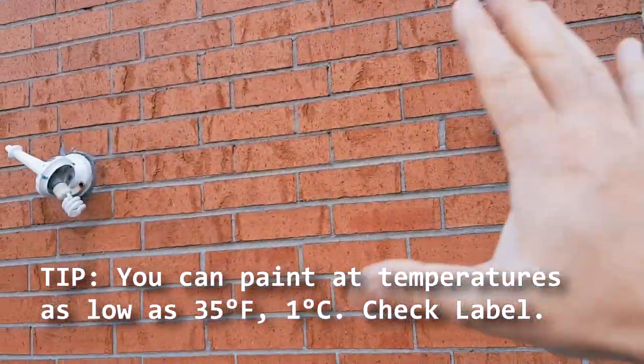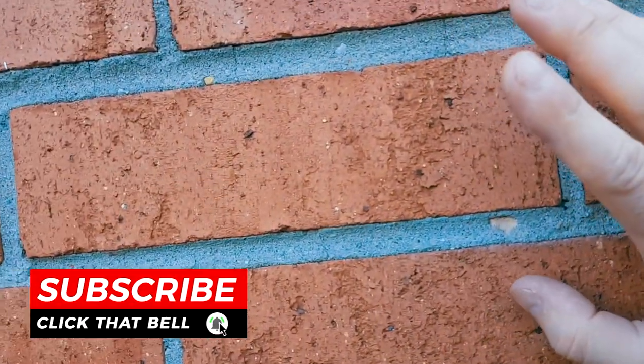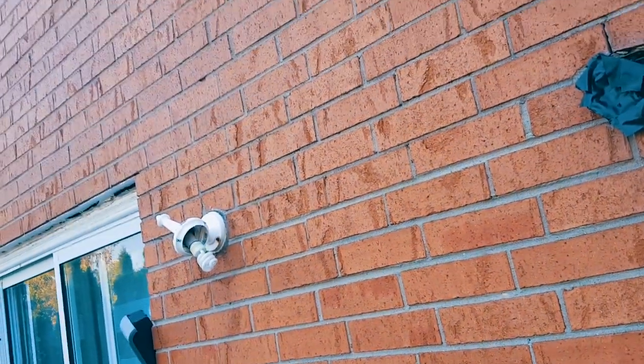When you're painting a brick wall you do not want to just seal it. If you're living in a climate where there is a winter season, meaning that water freezes and then thaws, if you seal it there's gonna be a problem because there's not gonna be any air coming through. That portion of the area could actually start deteriorating under the paint and you would never know because it looks perfect on the outside.